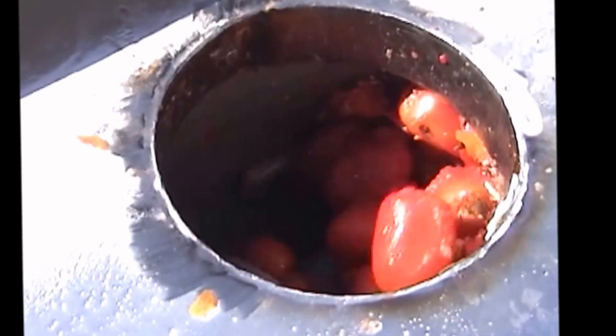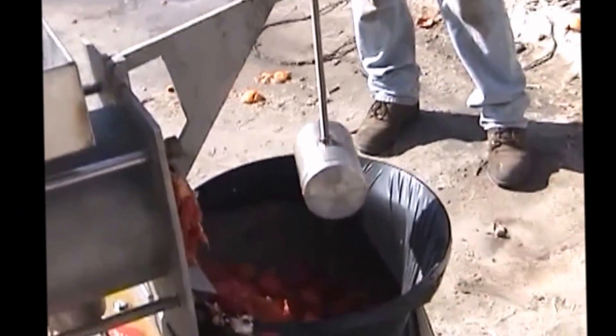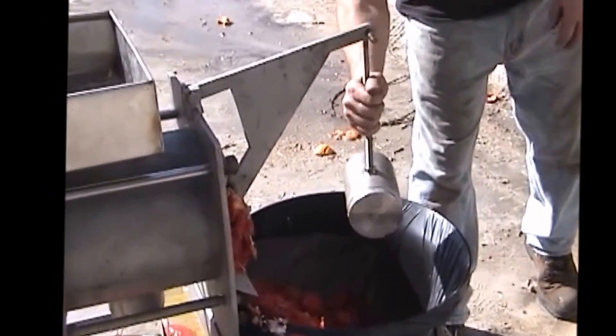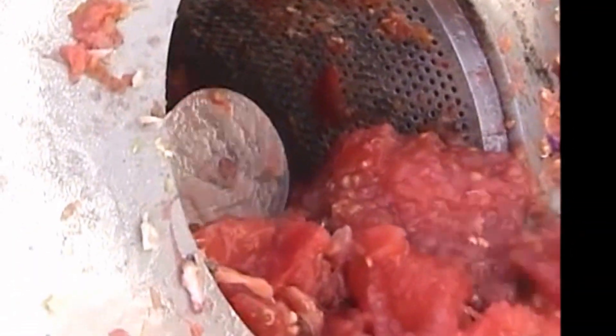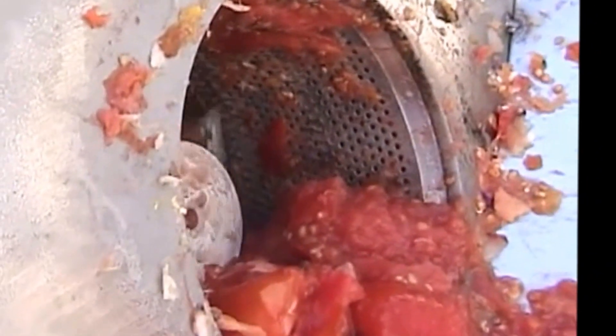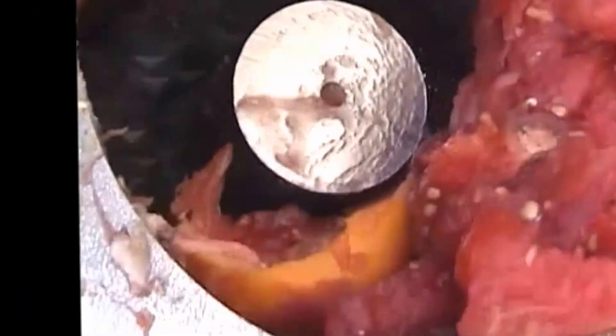This is not a positive displacement screw press — there'll be a lot of turning. Then the question comes up: how do you clean out this machine? What we need to do is take off the weight, and this door starts to open more on its own accord. There you can see the perforated screen that we're using — we selected a heavy screen for abrasion resistance. Those bags may have snuck past us — they may be wrapped around the shaft in there somewhere.